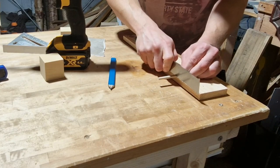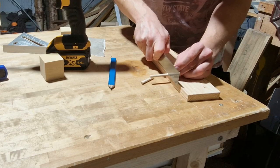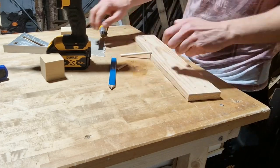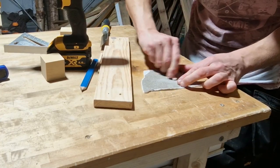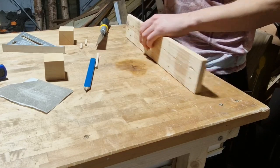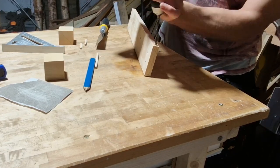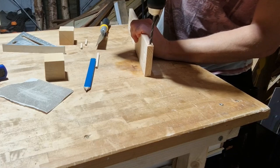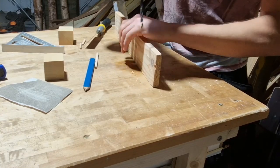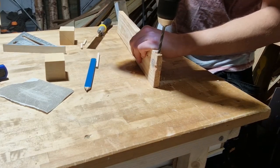If you want to see a better-looking clamp storage solution, watch part one — because this is quick and dirty and something that could be made in under an hour. My solution to the clamps coming off the side was to cut two dowels, round over the edges, and then pre-drill some holes. These are six mil dowels so I've attached a six mil bit. The clamps hook over this face, and the dowels go into the ends to stop the clamps moving from left to right.